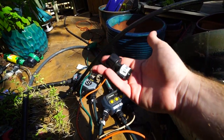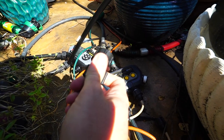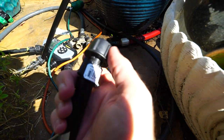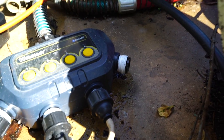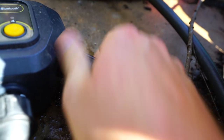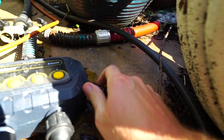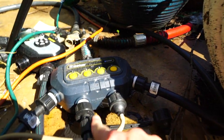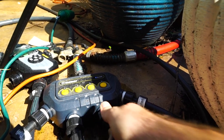This is a hose-end adapter. Pretty simple to use — you just push this end in, this piece screws down, and then this piece screws on here. You can see I've already put some plumber's tape on here. These things tend to leak like crazy. Make sure it's on there nice and tight. Don't want any slack, don't want it on crooked. Sometimes I have to come through and make adjustments — one of these is dripping and there's a puddle here that's not supposed to be there.